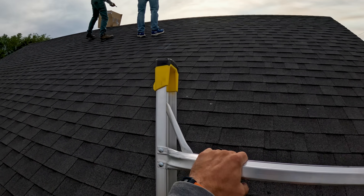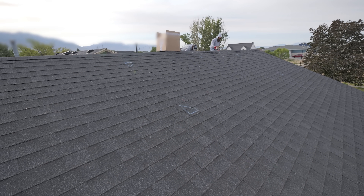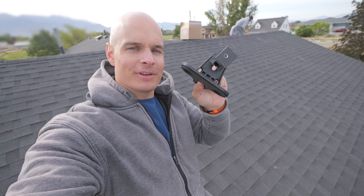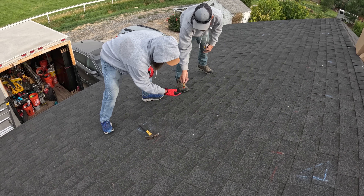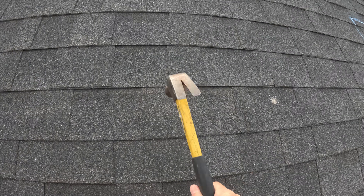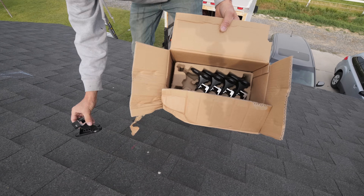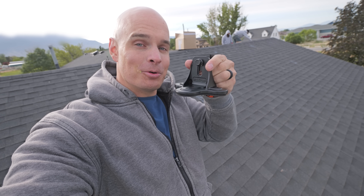To get our 1200 watts of solar, we have four panels already laid out in the center of the roof. Instead of needing to find a joist underneath the shingles, companies are moving more towards a deck mount system where you can put these feet anywhere on the roof. We're still finding the joist anyway using a hammer and tapping the roof until you hear something solid, just for an extra level of getting more threads into the wood so they attach a little better — but technically speaking, you can put these anywhere.